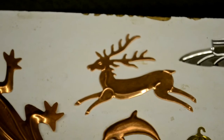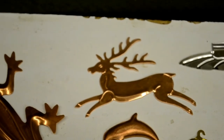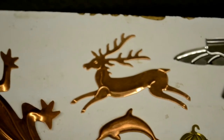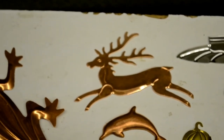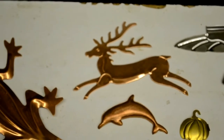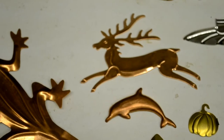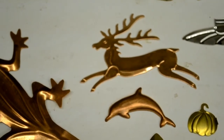For the stag, I used wires soldered onto the die, then heated that up and melted it into a nylon block. The nylon block becomes a female conforming die to allow the part to form more easily at less pressure.